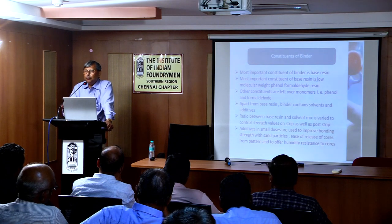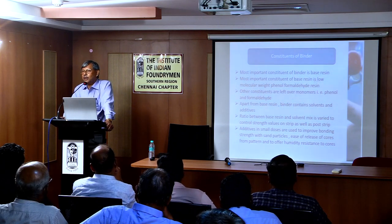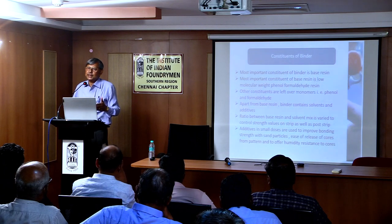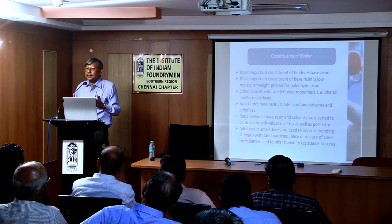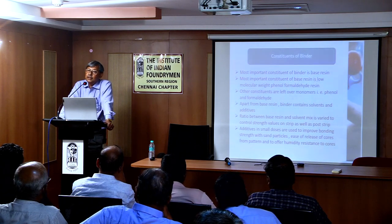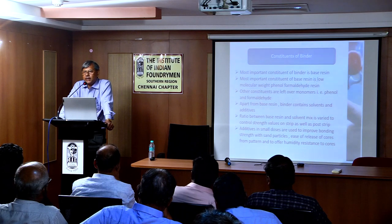So now you know base resin and solvents. Now, base resin: how much base resin and how much solvent? That makes a very huge range, maybe from 50% to 65%. And within this range, there are so many properties you can change. That is the first step of customizing the formulation. For the sake of secrecy, I cannot disclose the variation of base resin and its effects on final properties.